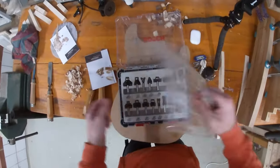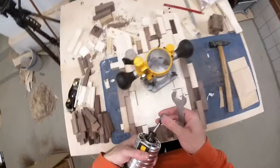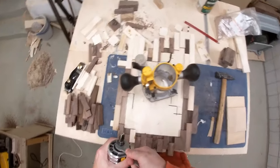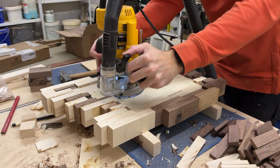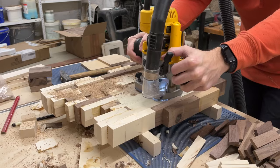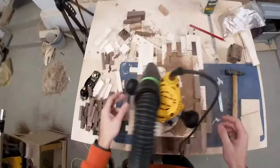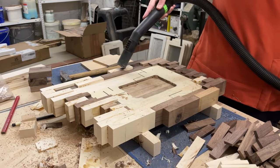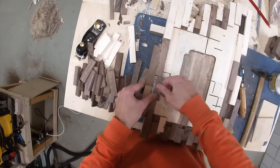We need a deep opening on the back of the guitar to accommodate the springs later. On the white guitar, these were milled with a CNC milling machine. I don't have a CNC myself, but this job can also be done with a router. And of course, all the fun has to be repeated on the back.